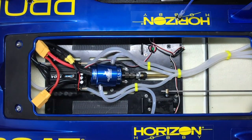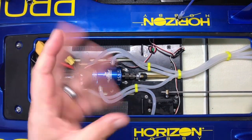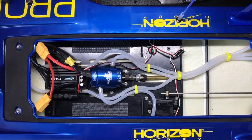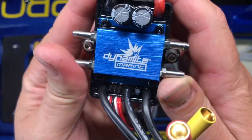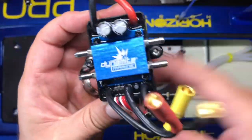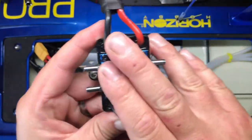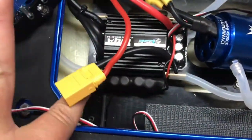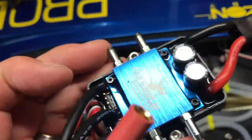This boat is fantastic, except for the fact it's underpowered — not motor-wise, but ESC-wise. This is the ESC it comes with: this Dynamite 120 amp ESC, water-cooled, but look at how small the heat sink is. I replaced it with a 150 amp ESC. Look at the size difference — huge difference. The 150 also has cap banks here and here. The stock one only has caps right there, with a couple half-assed ones, which I thought was kind of cheesy.